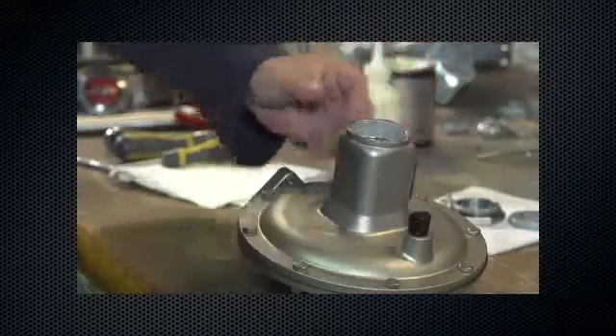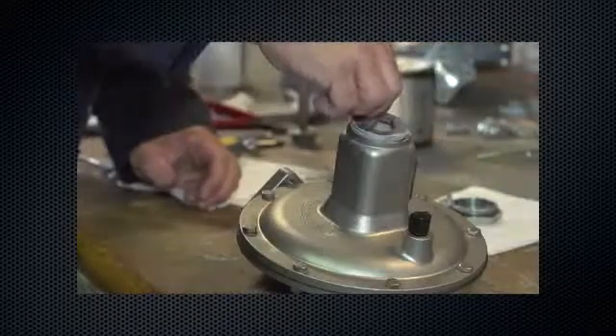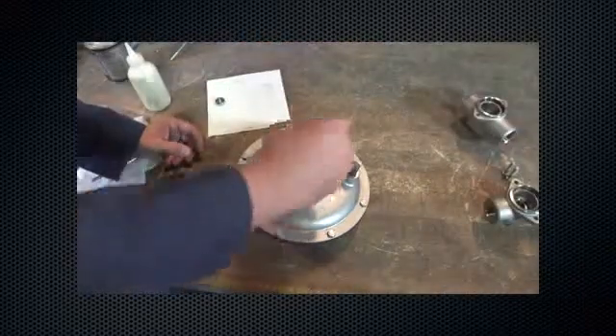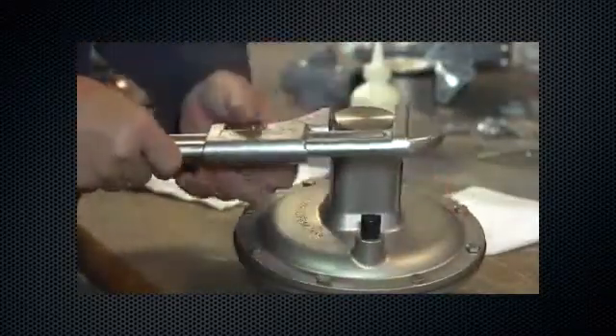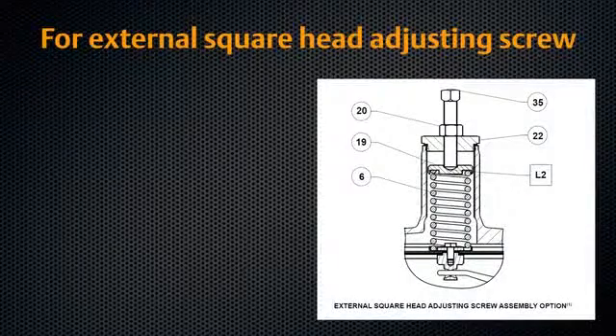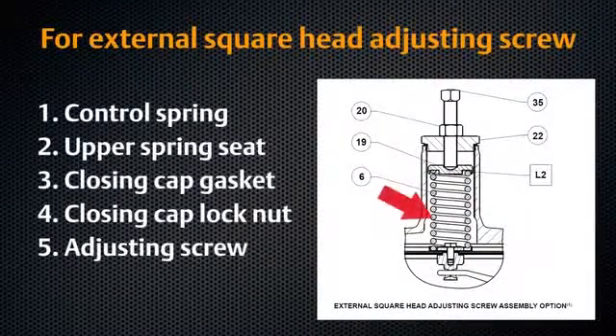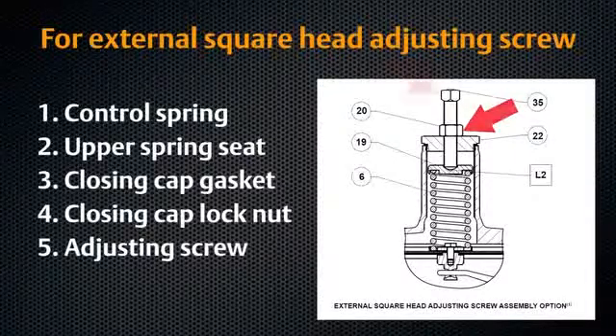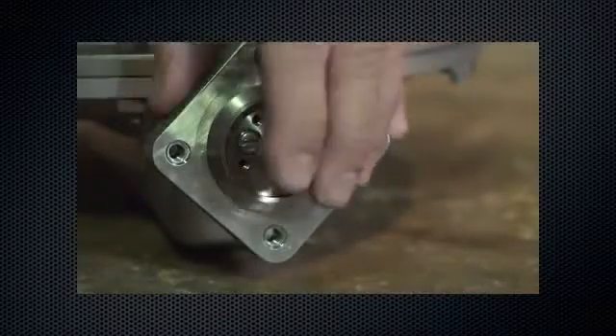For the flat circular adjusting screw, install the control spring then the adjusting screw. Install the closing cap, lock nut, control spring, upper spring seat, closing cap gasket, closing cap lock nut, and adjusting screw. Install the disc assembly to the stem and secure with a cotter pin, bending as shown.